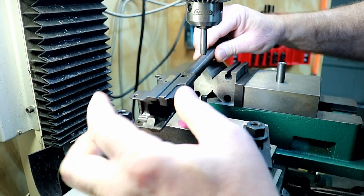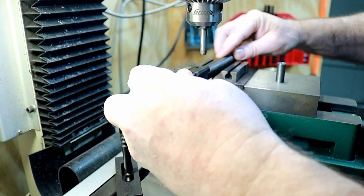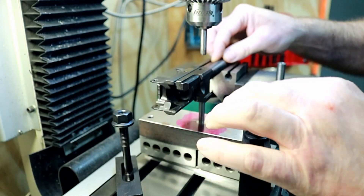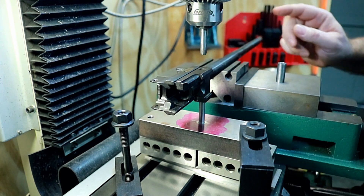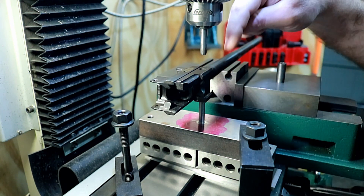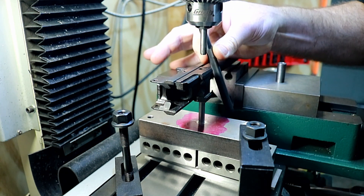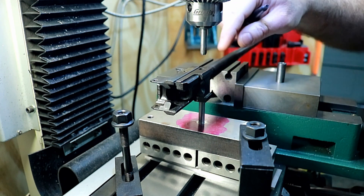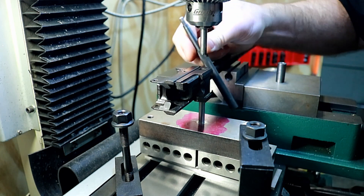With that pressed in there and riveted in through the receiver, put it in the hole there. If you get it all squared up where you need it, don't ever 100% tighten or snug everything down. Sometimes these barrel pin holes are not drilled perfect — sometimes that barrel pin hole is drilled off-angle. That's where the V-Block comes in handy. If you were to rotate this, the V-Block would get my barrel pin correct this way.